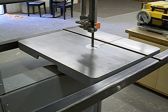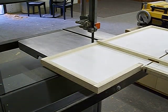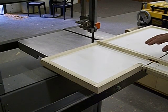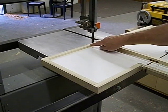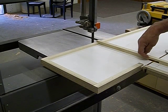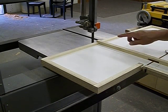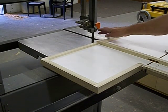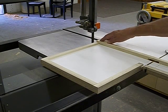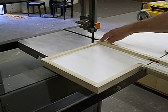I have this panel here that's fashioned — pretend this corner is still there. The perimeter has got a space built up to allow for the clearance of this clamping block. You can see this clearance is developed right here where this notch is cut. Then the extension of this runner here, which goes in the slot on your table, is the thickness of the slot minus a sixteenth. The reason you want it less than that is so it doesn't drag in the slot and cause problems introducing the jig into the bandsaw.